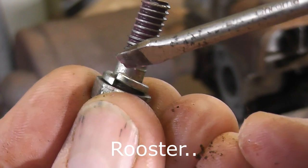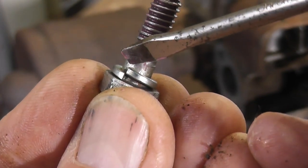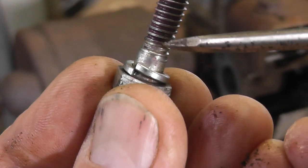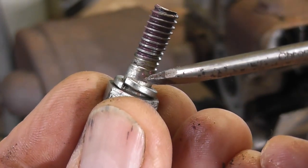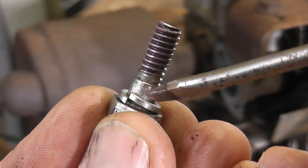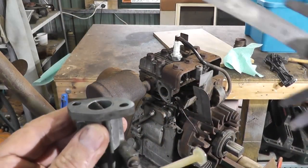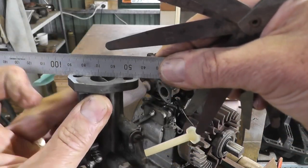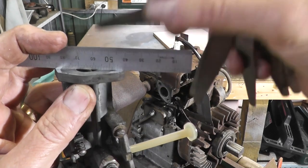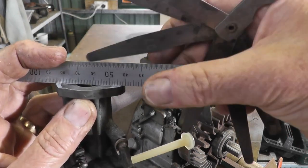I'm going to put these in with a spring washer. The reason you don't put a flat washer on a spring washer — as I was always taught — is because that sharp edge bites into the job and underneath the head of the bolt. If you put a flat washer as well you may as well not bother with the spring washer, because the flat washer will constantly rotate against the job. I've put some purple thread locker on there so hopefully these won't ever come loose. I've cleaned that up with a file, got it pretty flat — it's about 7 thou with the feeler gauge, which is good enough for this old girl.